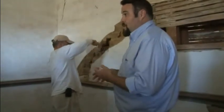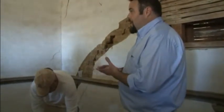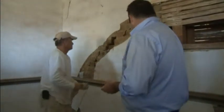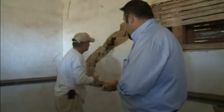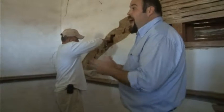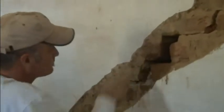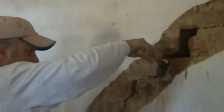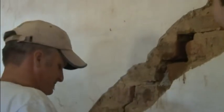Casein is also one of the special ingredients in our traditional limewashes. When you take just lime and water and make a limewash, you're looking at anywhere from eight to ten coats, and it's a little dusty — you'll walk away with a white hand or a white shirt. With casein added, it actually solidifies the paint a bit, so you can get away with two to three coats and it has virtually no dusting at all.